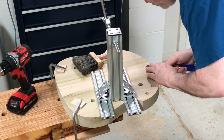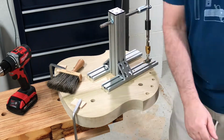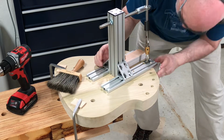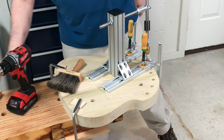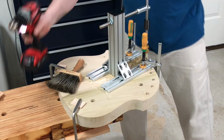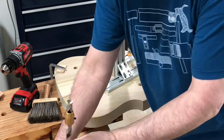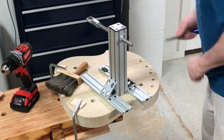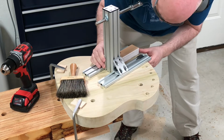And it's a bunch of rinse and repeat. So now we move down the other end. We're drilling now the number 2 spindle on the other side at 8 degrees. And just like that, there we go. And again, I'm using a little wire tie just to clean out between the flutes, and the chisel there just to remove the fuzz from the top of that poplar seat.